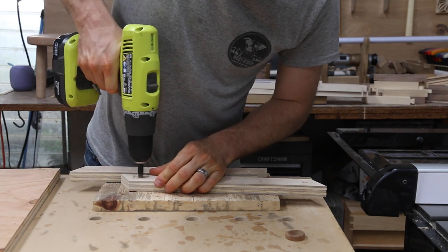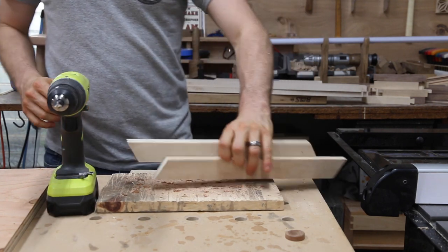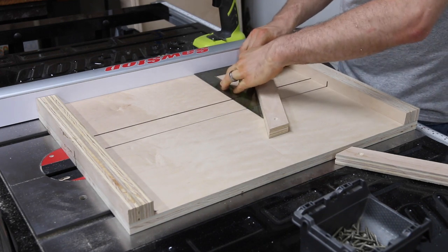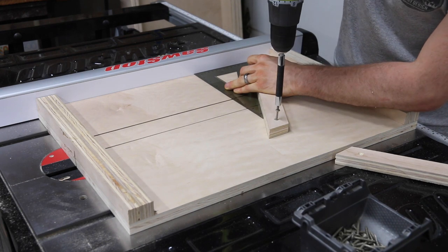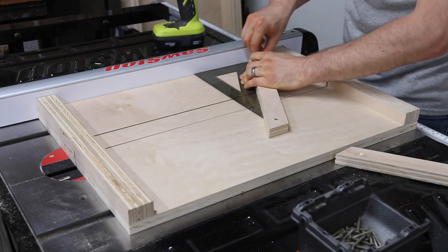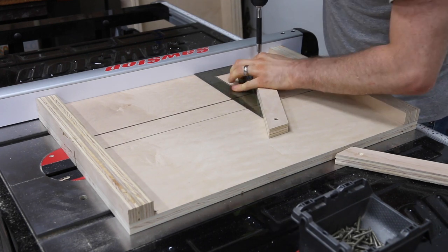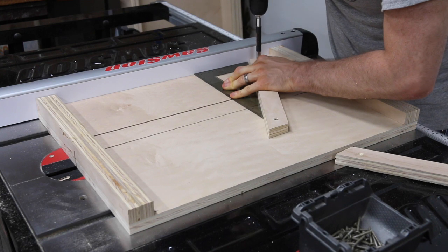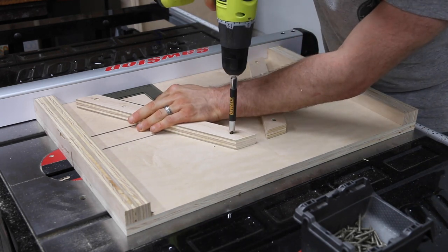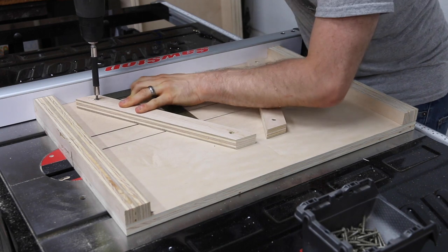The fences that matter most on this sled are the angled fences. They need to be exactly 60 degrees off of the reference edge. Off-camera I cut the ends to a 30-degree angle on the miter saw, then drilled a countersunk hole in both ends of each fence. Back at the table saw I positioned the sled into the miter slot, slid the fence up to the reference edge, and got out my 30-60-90 drafting triangle to position the angled fences perfectly. The angle is super important here, so having a good reference is critical. If you're looking for a 30-60-90 drafting triangle, I left a link in the description below to the one I use. You can absolutely use a bevel gauge and an angle reference block to get this angle — I just don't have a good reference for 60 degrees except this triangle. Notice that while I'm drilling and driving the screws, I'm holding everything together firmly: the angled fence against the triangle, and the triangle against the table saw's fence. This will ensure accuracy.